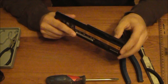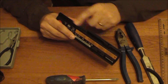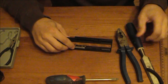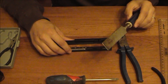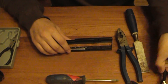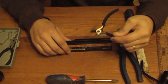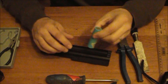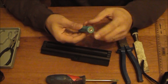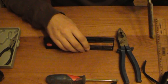Most batteries are put together with a seal around the edges — that's where we attack the battery, and inside there's just a simple glued-in seal. They're not designed to be serviceable. All you really need for this job is a decent-sized chisel, a screwdriver to get the batteries out, and either scissors or wire cutters to cut the tabs to free the batteries. When you get them out, you'll have little solder tabs on the ends — you can peel these off carefully or just flatten them down, but be aware they are really sharp.